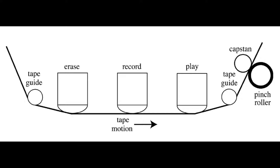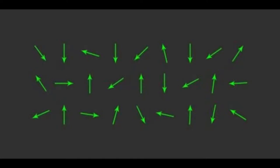How does this erasing work? Well, the erase head uses a strong, very high frequency magnetic field, and the high frequency is around 100 kHz. This magnetic field shakes the magnetic particles into a pseudo-random layout where the magnetic particles face every possible direction, thus effectively making the tape unmodulated, not carrying any signal, and thus silent and noise-free.